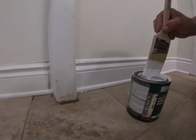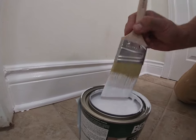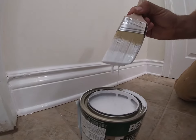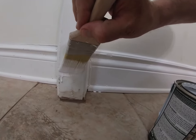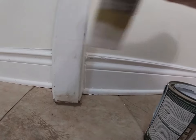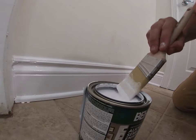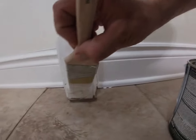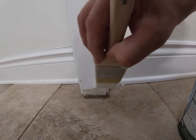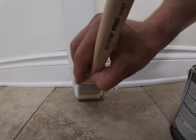Same thing with door bottoms — or just a piece of trim. See how dirty it is. If I was to take this and just put it on the wall right now, close to the floor and start painting — see what happens? It just starts to drip. That's why I want to clean one side. I'm not going to go right to the floor right away; I'll just try it, see that it's a bit too much, get rid of the extra, and then from there keep getting closer.